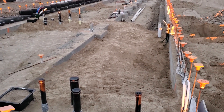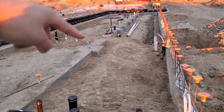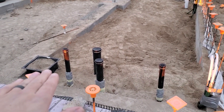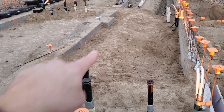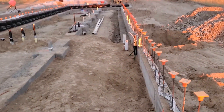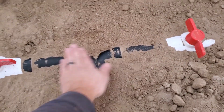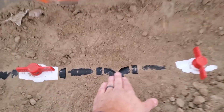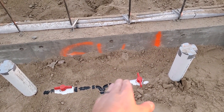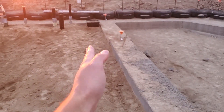We had to notch out the top of this footing — don't worry, we got the okay from the engineers — because we wanted our gray water to run as high as possible so that it could actually feed properly into the planter. Same thing here: our gray water lines are very high, going along there, and they basically join together and are brought over to here. At this point we've got two valves. One drains back to this side — if we close off one side and open up the other, this will just drain back into black water and exit the house.